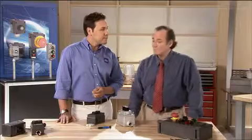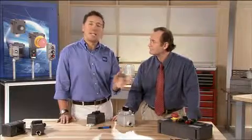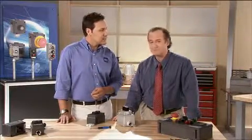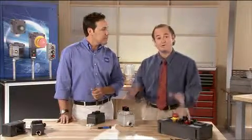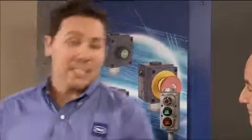Exactly. Well, so what about seals? Do you need conduit seals here? Nope. Each of the devices inside are encapsulated. They're inherently safe, so you don't need any conduit seals. Great. One less thing to fail. So now you've got options. And it looks like the STAHL solution can really save you a lot on labor cost. And since it has universal certification, skid makers can ship those anywhere in the world.